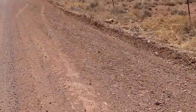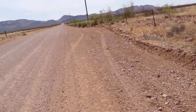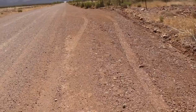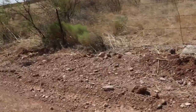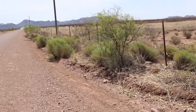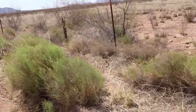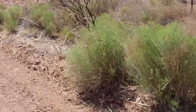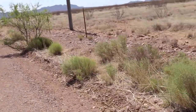We are now on the north end of the property. This road is a larger road, much more compact with the gravel. I think we have even more ability to catch runoff from this road. The idea here will be to increase the trench already along the side of the road and trench that onto the property on contour. If we can get that water to spread right along the flat surfaces of the land, we can get it to spread out evenly and soak into the soil.